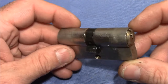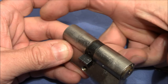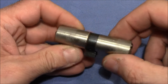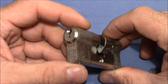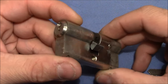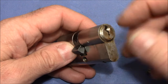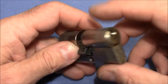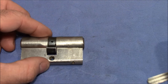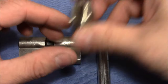That was a very easy Eurocylinder to reassemble, and that's because first of all it's short — the longer it gets, the more difficult it becomes. Also, these connection elements look different on different models of Eurocylinders; some of them are more tricky to put back together. Also, the driver pins were quite long, so it was easy to put them in the chambers. All in all, this was just an example of how to reassemble a Eurolock with a plug follower that has a slot in it and a pinning shoe.